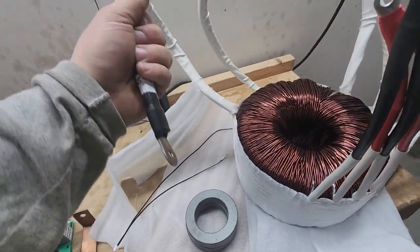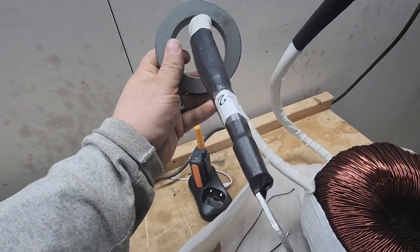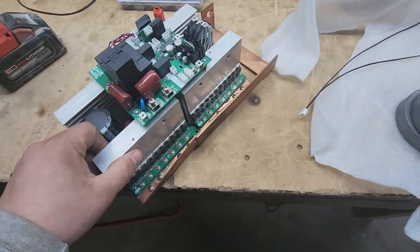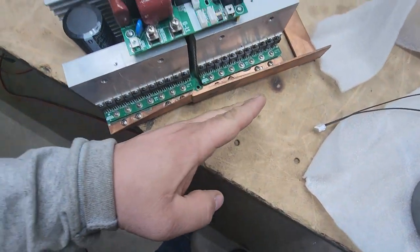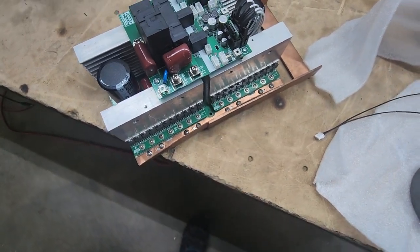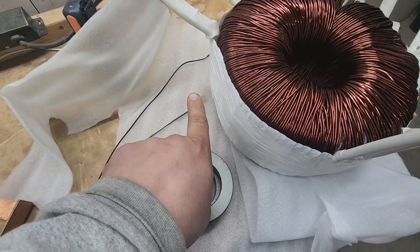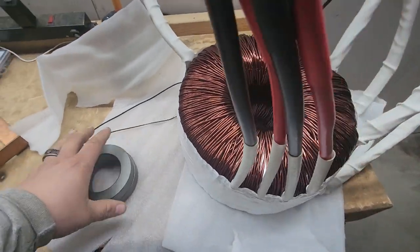The only thing is it's going to be hard to work with these. These have to be wrapped, like I said, at least twice, and I'm shooting for three times. If I can get it to wrap three times, remember, it still has to be able to reach this main board inside the chassis. Now, it's close. If you've seen the inside, the transformer is about right here. Sid absolutely loves to make things as small as possible, so I don't think I'm going to have a problem, but you never know. If I wrap it and the primary comes out to about right here and I can't get it to wiggle its way down, then at least two, but three is ideal. We'll see if I can get three.